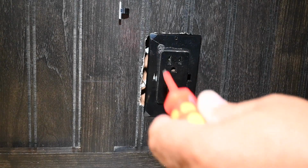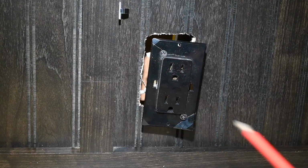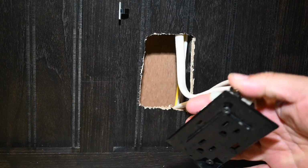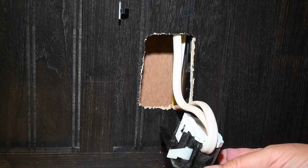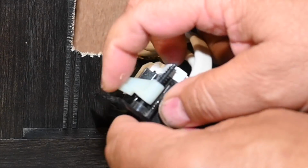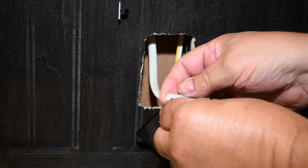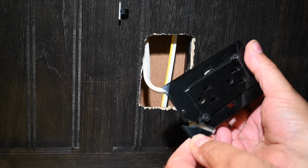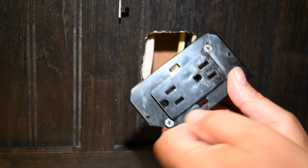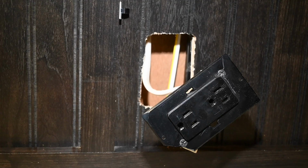These outlets are held captive by these little toggles. Just loosen both screws. And you can see the toggle, what I mean. That's this little mechanism here. And it will fold back on itself, and then when you tighten it, it will swing out. And of course, this falling off is just poor workmanship. That's just some inexperienced person not knowing how to use a power tool.